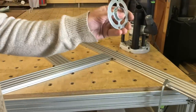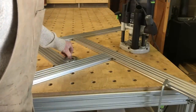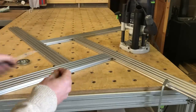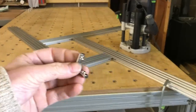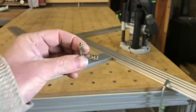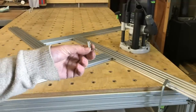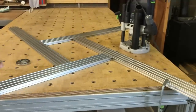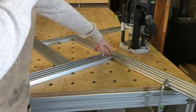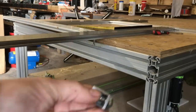A very important part of a router jig is to have the corners completely clear, so that when you're using either a bearing-guided router or a ring guide it can go all the way round. This is done on this profile with one of these little connectors, and they're really inexpensive — you get five of them on Banggood for something like £1.80 including postage.